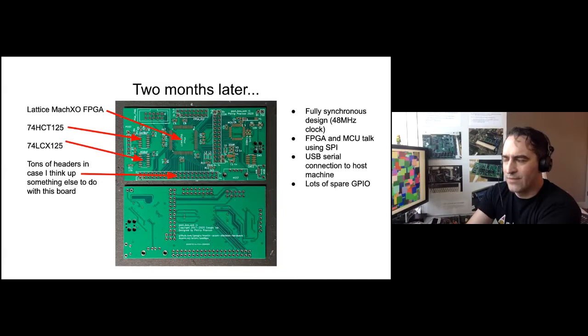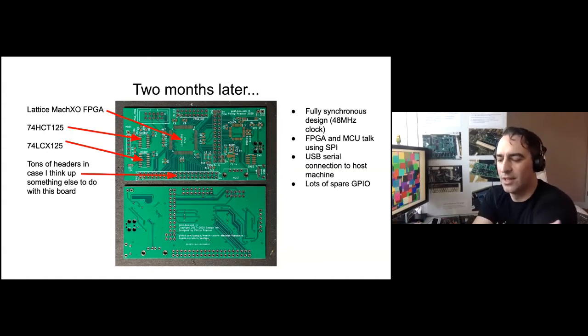Having given up on the A5000 and fixed three A3000s, I was at a loose end, so I decided to make a better version of my flaky CPLD post box. This was something Phil Pemberton was also thinking about — using this exact FPGA, which is one I happened to buy a few of a while back and was looking for an excuse to use. It's a really small FPGA, but it also happens to be basically as big as the biggest CPLD you can buy. The FPGAs start where CPLDs finish, and a $2 FPGA is equivalent to like a $30–$40 CPLD. Definitely a nice upgrade, but they are modern chips — they don't like running at five volts.